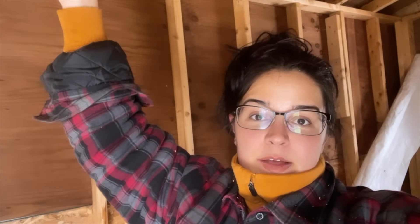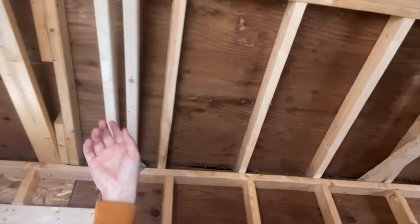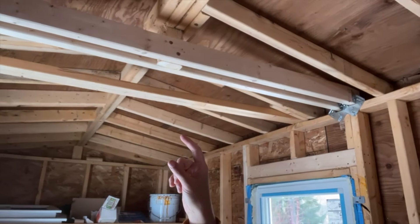It's really cold — there's a major temperature change because I had about a three or four month break on the tiny home. I actually lost the footage of myself doing the roof, so I have to talk you through it from inside. I ended up putting a basic pitched roof on — I think it's classic, it looks really pretty, and it's going to go with a refined cabin theme on the inside. I'm going to wrap the collar ties in pine and stain them so they look like faux beams. There are two of them right now and I'll probably add two more — they won't be structural.